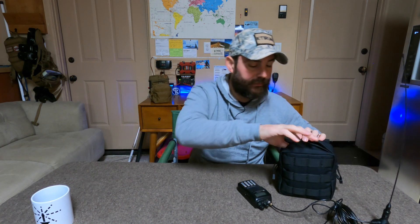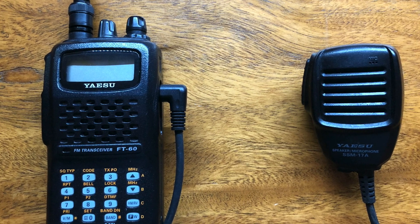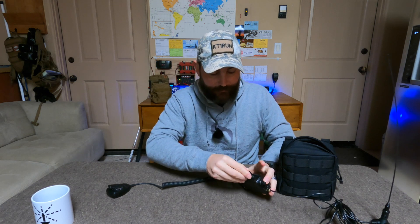This basically allows me to relocate the antenna from my HT, so now when we're in the vehicle I have the ability to have the antenna outside, giving us better RF radiation and a better chance of making contact. The one awkward thing is having to drive and also hold the HT in your hand — not terribly safe. So the second piece of gear I carry is an external hand mic, the same one I use when trail running, clipped directly to my chest rig. This streamlines the operation of easily keying the mic and making the necessary contact.